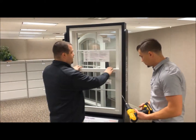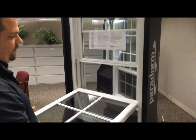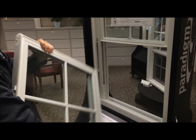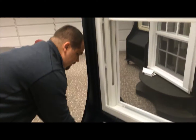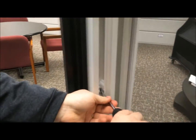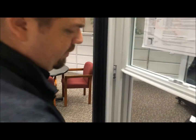The first thing you're going to want to do is open up your bottom sash a couple inches, tilt it in like you're going to wash it until it's about flat with the floor, and then lift up on the bottom of the sash. Next, you're going to want your flat head screwdriver to turn the balance cam and let the spring compress back to its original position.